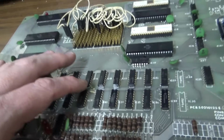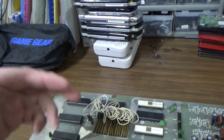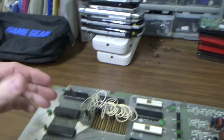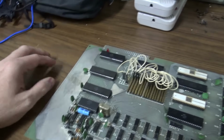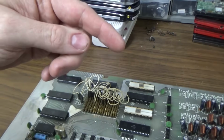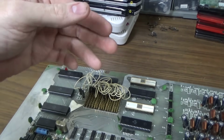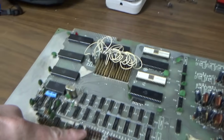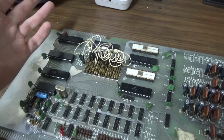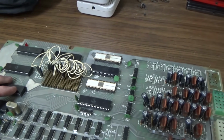Now, how would that happen? Well, let's say you got a solenoid here and it doesn't work right, so someone has cut the wire loose and the wire is just hanging down in there and it leans over and it touches one of the lamps. Well, you just sent, I think it's 27 volts or something, 26 volts through the lamp that's supposed to be 5 volts or whatever into the chip, and it might not like that, right? So that's the thought process behind that.